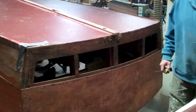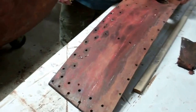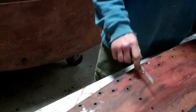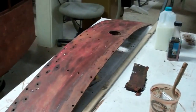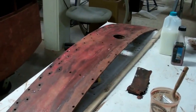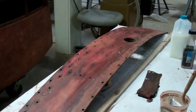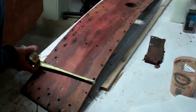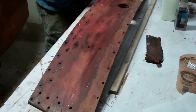Most of it's beneath the waterline. So it will be painted up to — I believe there's about two inches, two and a half inches exposed. We don't face a huge problem of matching grain there. Two and three-eighths inches exposed is to be varnished.